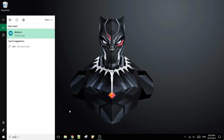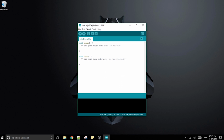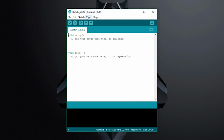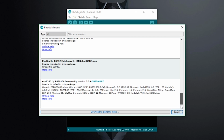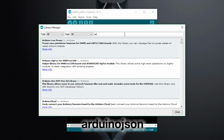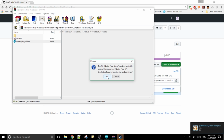If you are using an ESP based board for the first time, download and install the Arduino IDE from the link in the description. In the IDE, go to File, Preferences and paste this URL in the Additional Boards Manager box and click OK. Now go to Tools, Boards, Boards Manager and scroll down to the bottom where you will find the ESP8266 listed. Select it and click Install and restart the IDE after the installation is complete. Now we need a library that is not included by default. Go to Sketch, Include Library, Manage Libraries and search and install the Arduino JSON library. That done, now download the code from the description and open it.